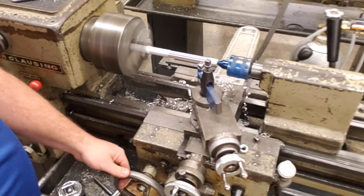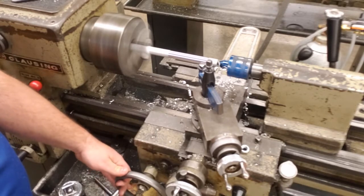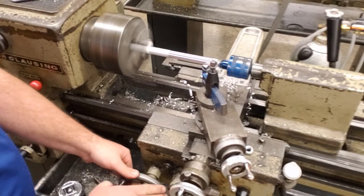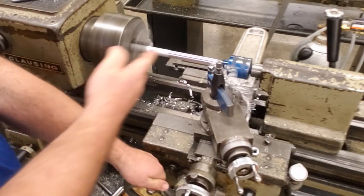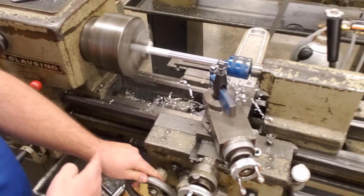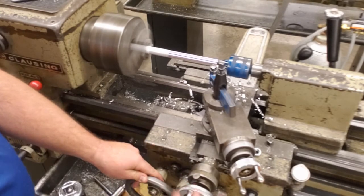As we're cutting, if there's a big string that develops, literally stop your lathe tool, stop the carriage, and that will fall off. So we'll continue to run down to the end. When we get down to the end, if there's a lot of scrap in the way, we can push our clutch down, remove that material, and continue to cut. Okay? At this point here, I'm going to continue to cut.